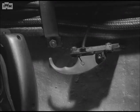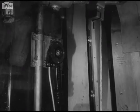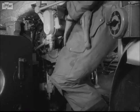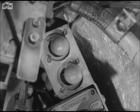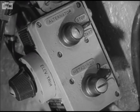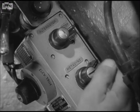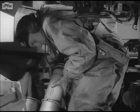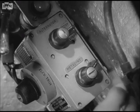This trigger controls the periscope washer. Opposite, behind the perspex screen, is the emergency power traverse switch. Here is the trimming and switch unit again with warning lights, alternator and metadyne switches, and at the side the elevation trimmer. The alternator switch is always switched on two minutes before the metadyne switch. Ensure that the loader is clear before switching the metadyne on, because the gun will probably jump and may cause injury when the gun control equipment takes over.